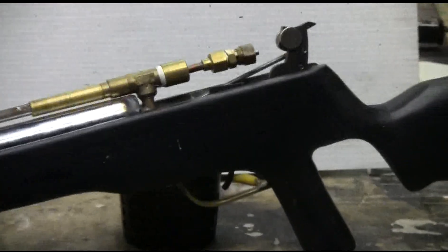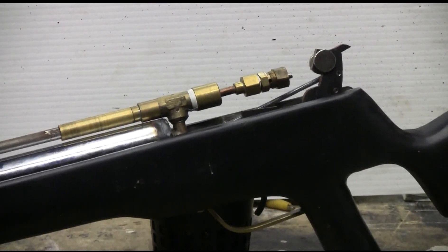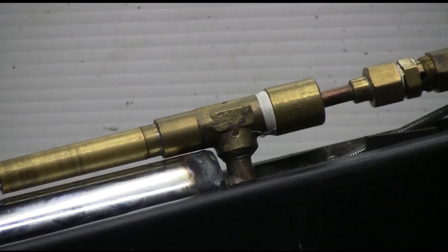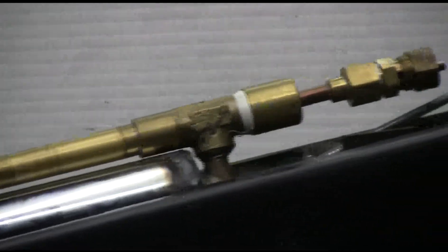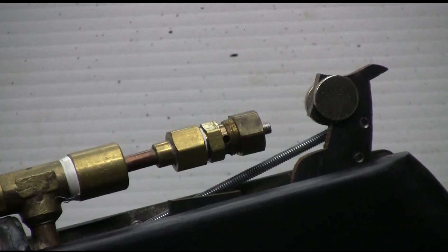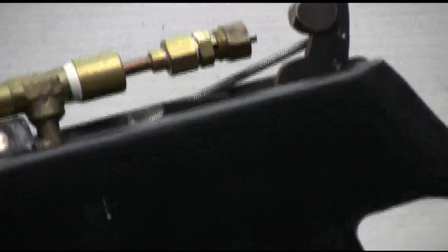This particular air rifle has a small brass piston valve — zoomed in here. That brass sleeve is a breech cover so the 25 caliber BBs can be loaded at the breech and the cover slid back to trip the piston valve. I built a small hammer valve out of some scrap brass fittings, then built a spring-operated hammer and trigger and trigger guard assembly.